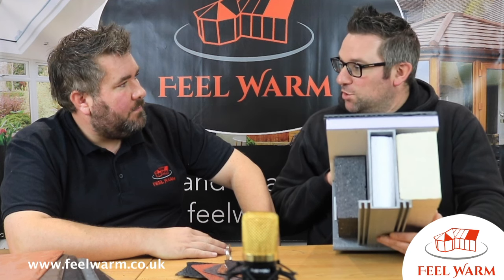Not without going through a huge amount of work to pull the whole thing down and replace the complete beam. The roof, take it all down. The beam that you put on there is a structural one. It's holding the ring beam up, which is obviously structural as well, so it's holding the building up. There are possibilities of maybe packing the roof up and removing a side at a time, but again, that's going to crack plaster, all that kind of stuff. So you don't want to go down that line. It's a labour intensive operation, with a lot of messing around.